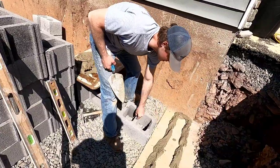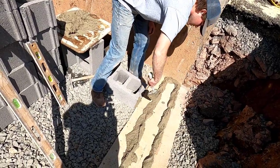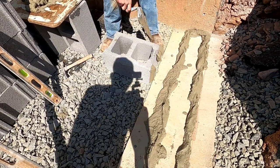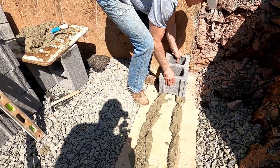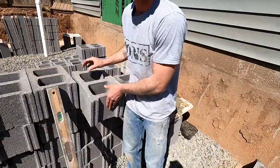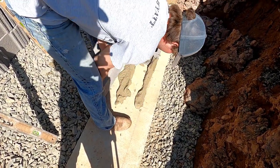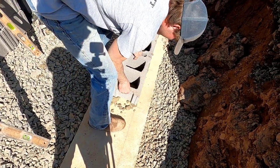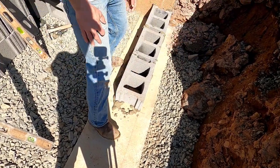Spread very nicely. Now it's time to head your block into your wall — in, out, in, out. Lay it right on your line, right into your corner, make sure you're tight. Last block for this row right on the line — watch out for chunkers under there. Right on the line, right on your bond mark. Now I've got to clean up my mud.